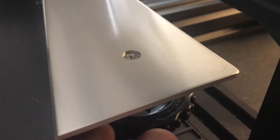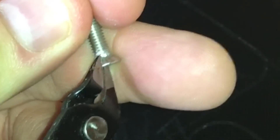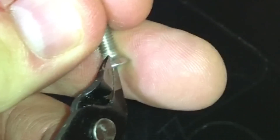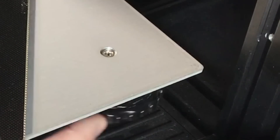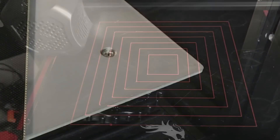So it was frustrating — I had to get rid of this. As a quick fix, I took the screw out and roughed it up with side cutters, just cutting little grooves in it. Very crude, just to see if this would allow me to level the bed. The screw was not turning, and I knew this wasn't a permanent fix, but it was something I wanted to try.